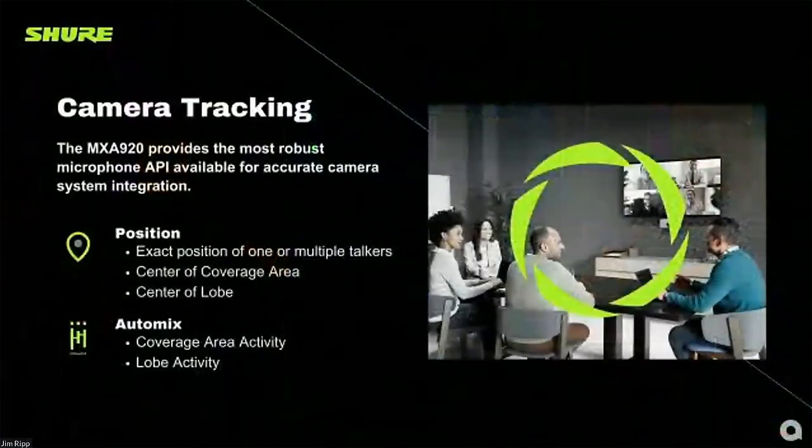So another very cool thing that the MXA 920 does is it allows you to work with video systems for camera tracking. This is becoming more and more popular nowadays, with multiple camera setups in a room, especially in a larger boardroom or training room application. The cool thing with the MXA 920 is that its API can output coordinate information to be funneled into a DSP or a camera controller. They partner with a lot of different companies that have camera tracking, like Aver and several others, which take that information from the 920s and turn it into a coordinate. It actually gives you an X, Y, and Z coordinate. That's really cool.